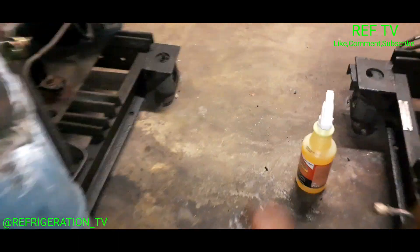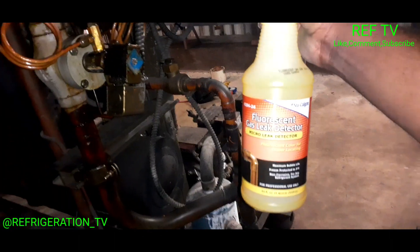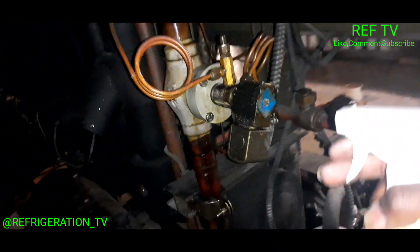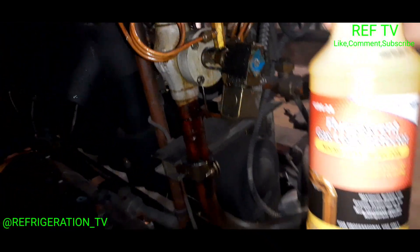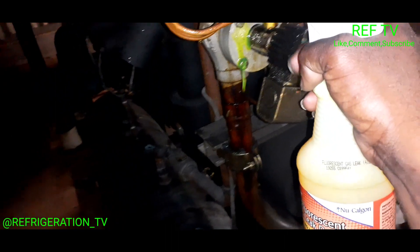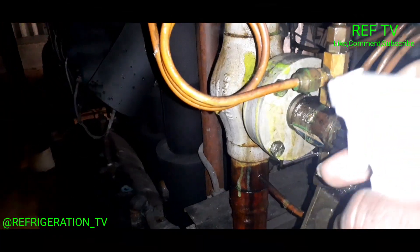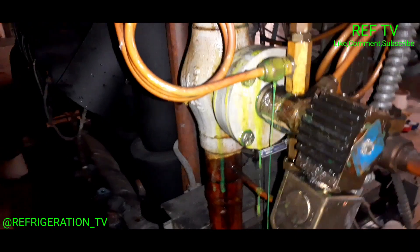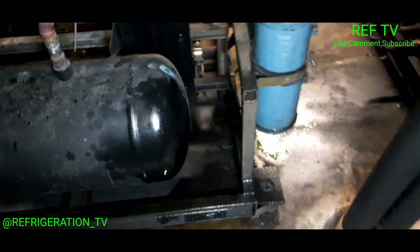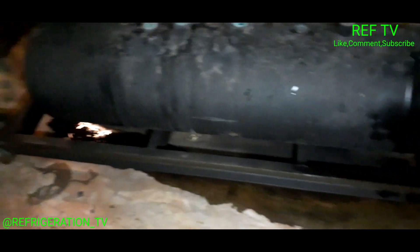Let me get my soap bubbles. Here's what I like to use — fluorescent gas leak detector. It's pretty good, that blue stuff, though it's kind of hard to see. If I had a choice I prefer this — just my preference. It looks like we just stopped the leak here, man. That was an easy service call. If that's only leaking here — look at that on the floor. Turn my light on. Look at that — this thing has been leaking for some time.